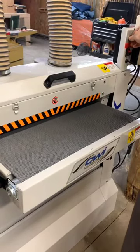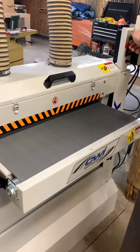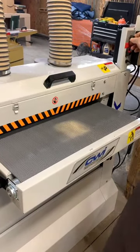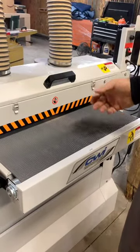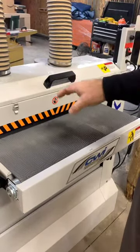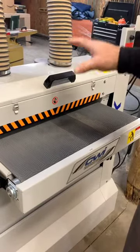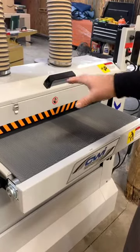You can slow it way down if you're sanding something pretty wide, or speed it up for smaller items. You'll find that setting number eight is probably your best speed so you're not overloading the machine. Now remember, this is not a planer — this is a sander. You're using this just to put your finished sand on your pieces or parts.